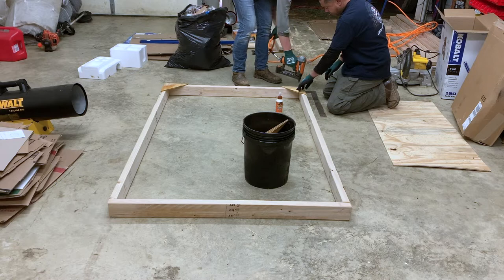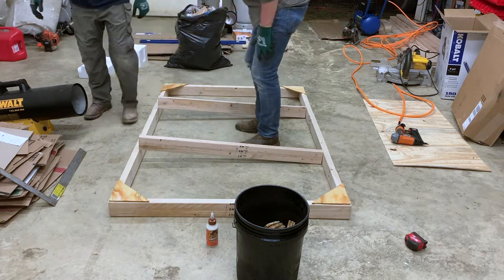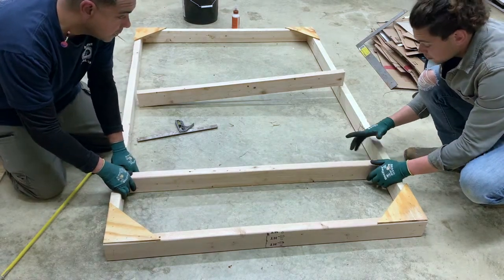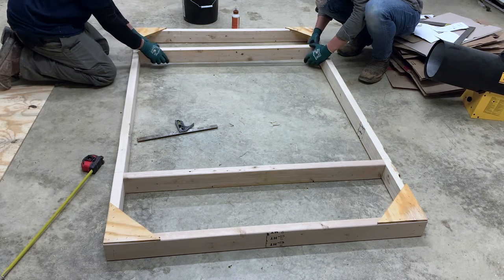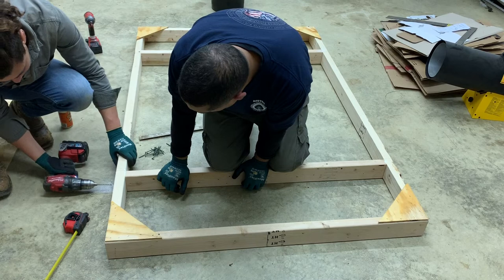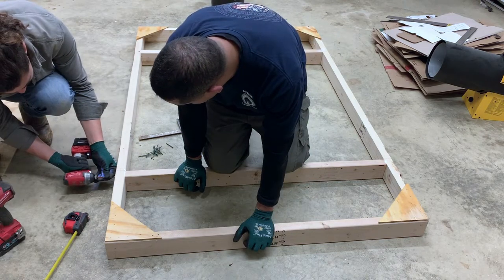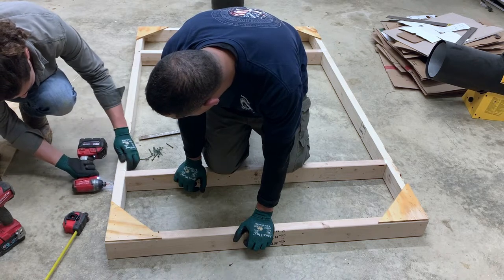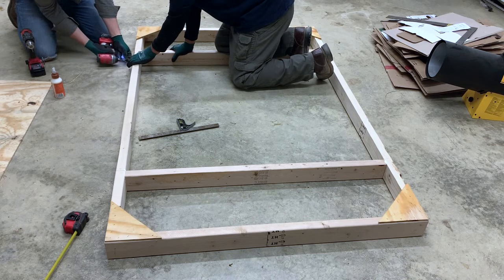This is how we handle our corners on this one. Justin puts corner braces in there with two by fours. In our case, we've used quarter-inch plywood and made little gussets out of it. It adds stability and strength but doesn't add a whole lot of weight. We've done this a lot of times in the past with our other chicken tractors. William is drilling and then chasing it with a screw — three-inch screws. These are not only supporting the bottom of the chicken tractor but also going a long way in helping to support the axle that's going to come later.